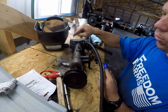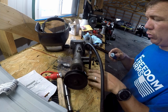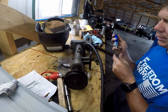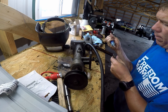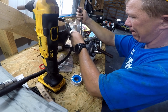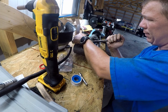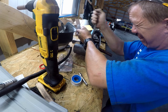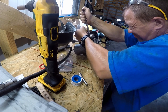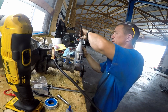On my machine, the bolts that hold the two angle drive pieces together were blue Loctited, so I'm going to go ahead and blue Loctite mine as well on the putting-it-back-together part. I would also say that you should definitely fill it up on a level surface.